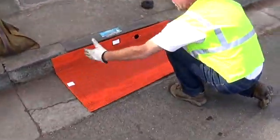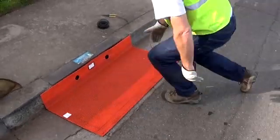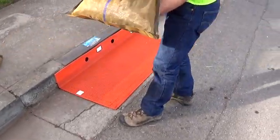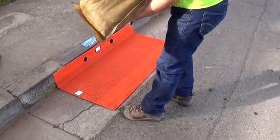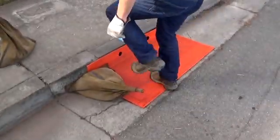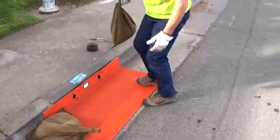You want to center it on both sides. Push it up against the curb snugly. Then just use gravel bags — any kind of gravel, not sand — filled about 20 pounds. There's some flexibility, so only fill the bag about halfway. Just kind of overlap it halfway on and halfway off the Combo Guard.